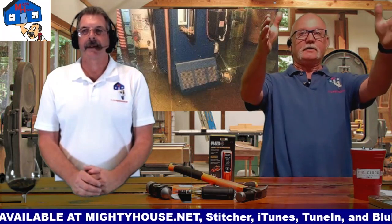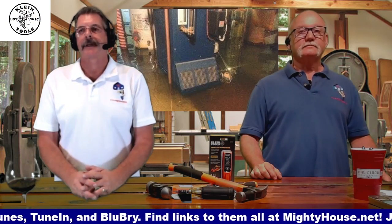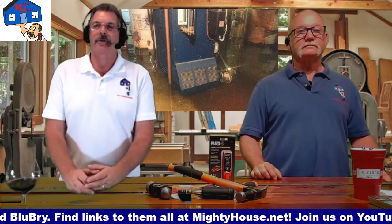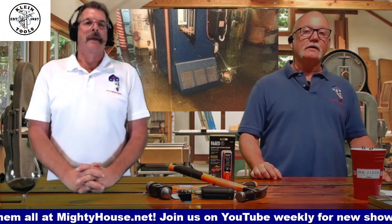Interesting. He's asking about tankless and why we mount those on the wall. That's just because it's easy to service when they're right here versus having to bend over and kneel down. You don't want to do that. So that's why those are mounted on the wall, because they're easy to service at eye level. Again, that's an added benefit that they're not sitting on the floor. If you got 5 inches of water in your basement, your water heater's 3 feet above that, and you're fine. That's a bonus.